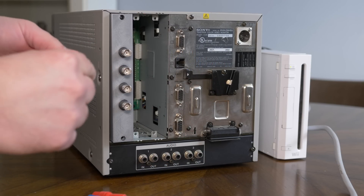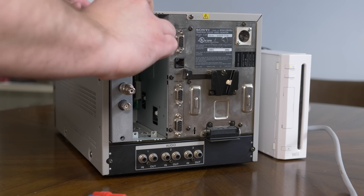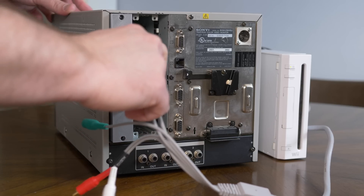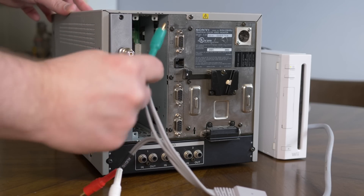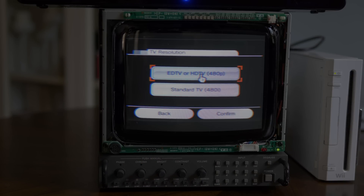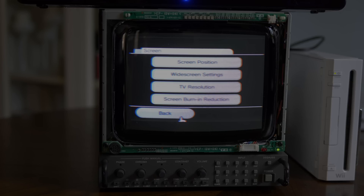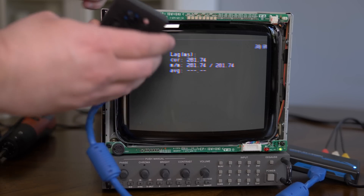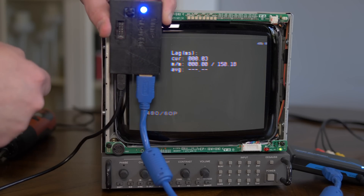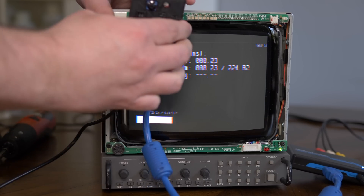I also wanted to test the component video compatibility of the card, so I added some RCA to BNC connectors to the inputs and tested a Wii. The original 129X card, as well as the monitors it's compatible with, should support 240p, 480i, 480p, 720p, and 1080i, so I wanted to test all of these. You can see it's compatible with both 31kHz 480p and 15kHz 480i, just like with the RGB modes. Using a Time Sleuth through an HDMI to component converter, you can see as I cycle through all the resolutions that it's compatible with every one, and all are 0ms of lag — including both converters used.